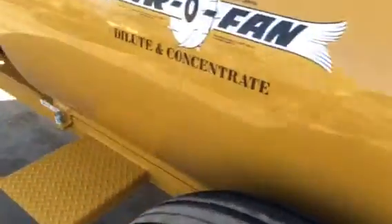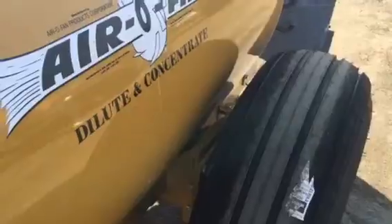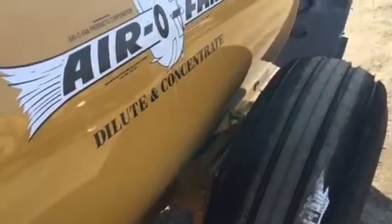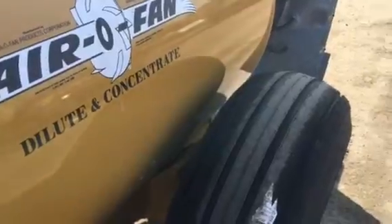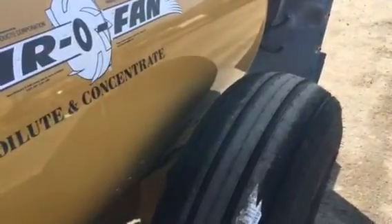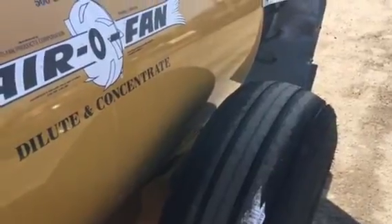The next thing to note is the wheel sensor. The wheel sensor is designed to operate in hilly terrain — so if you're coming off of a hill or coming up to a hill and your tractor slows or speeds, the calibration on the wheel sensor will allow that calibrated ground speed to adjust so you're constantly targeting what you're trying to spray.